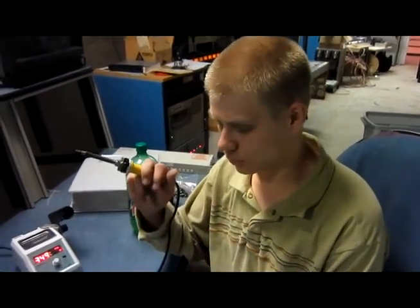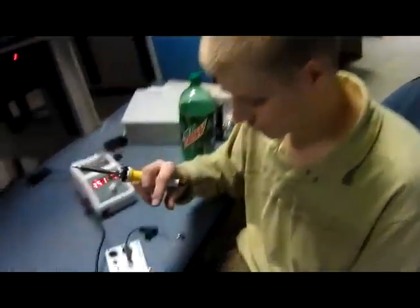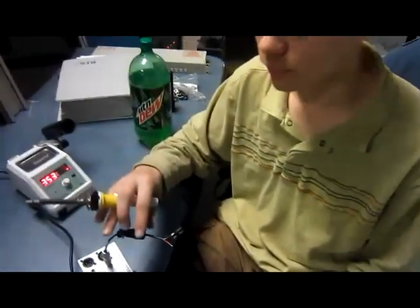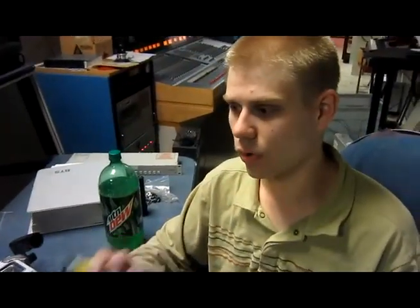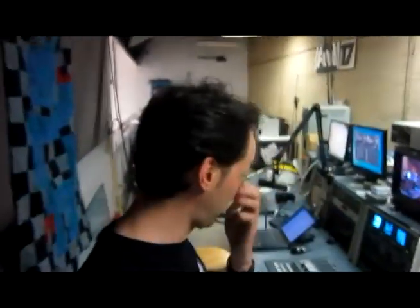Hot is tip, cold is ring? Well, positive is tip, negative is ring, ground is sleeve. Okay. Your positive is what? Tip is pin 2 on the XLR, negative is 3, and then ground is pin 1. Okay. So this is for audio between the Mackie mixer and the broadcast audio processor, which we're trying to install. The Orban thing. Yeah, the Orban. So we've had 2 fails today.